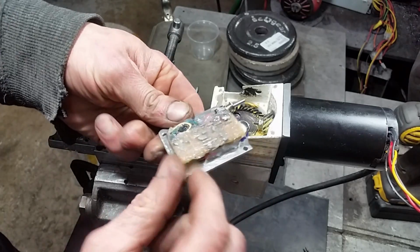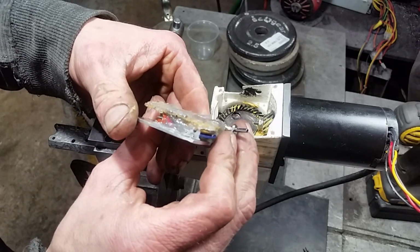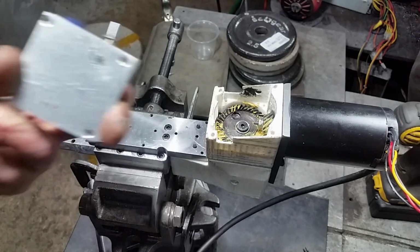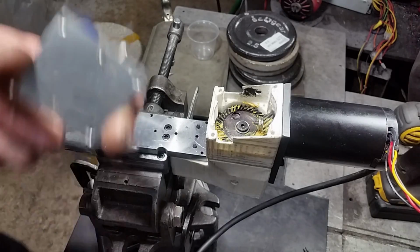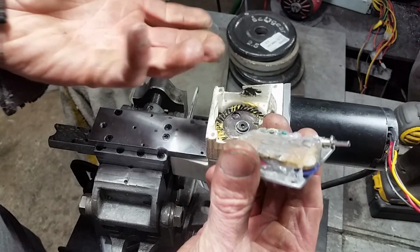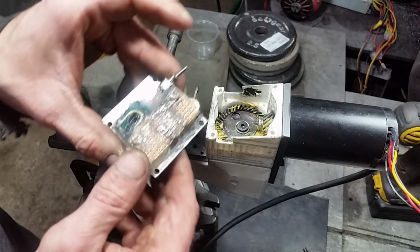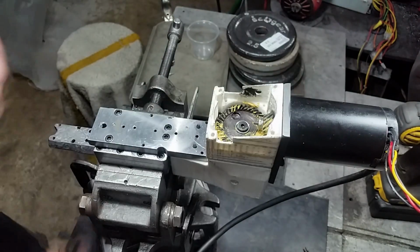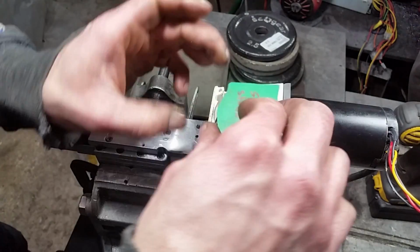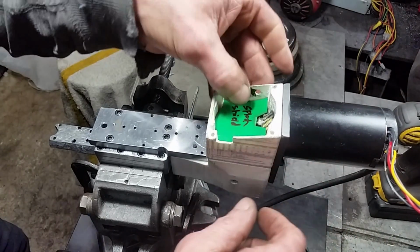So this is set in epoxy underneath. All the components on the back side of this are potted in epoxy, and then on top of it is silicone. The idea being the epoxy is going to hopefully keep the connections from vibrating about, and the silicone is going to hopefully keep vibration from going in there at all. Also, I've potted the whole thing because I didn't want grease to get in there. I had this the first time I assembled this, so I need to maybe modify this to work. Ooh, I got it pretty close.